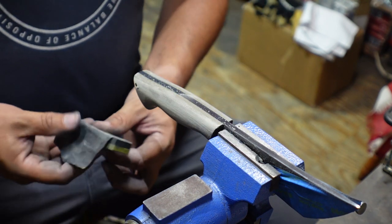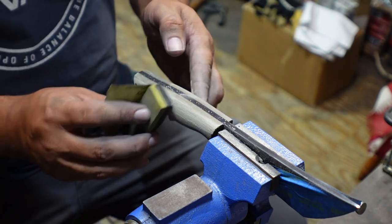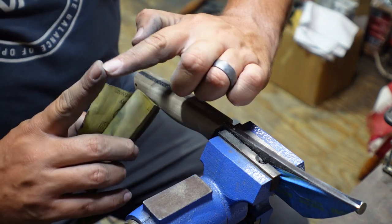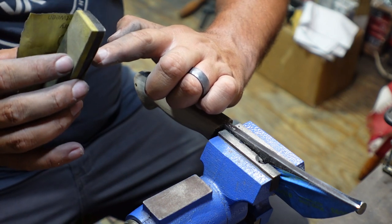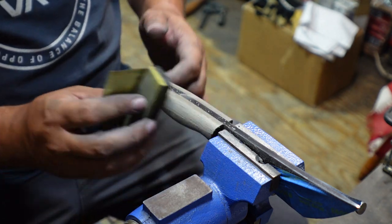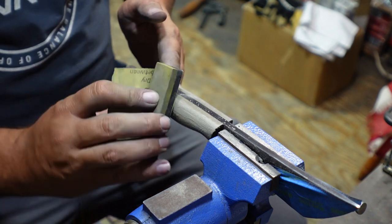Now, what I'm doing here, I'm not just sitting here and sanding like this, because I do want to blend in any of the harsh lines. I'm sanding past those lines so we don't intensify the hard lines. We just remove the tops of them. So if we had this point right here, we wouldn't sit here and just sand on either side of it. We'll cross over and slowly work it to where we're nice and rounded, and we're evening that roundedness all the way down. So that's why I'm still cross hatching it and going different angles.